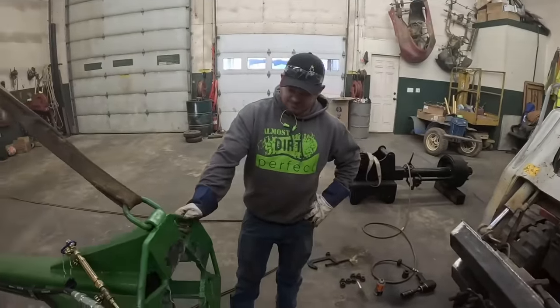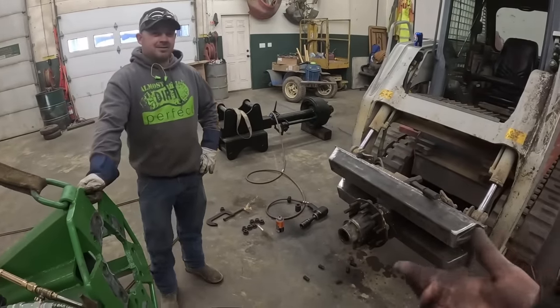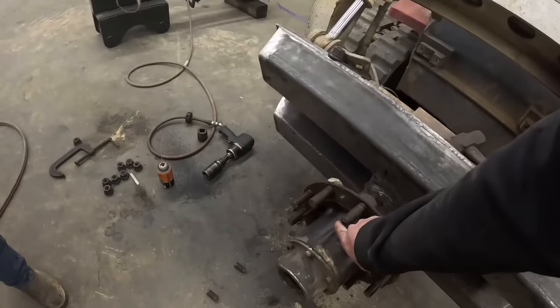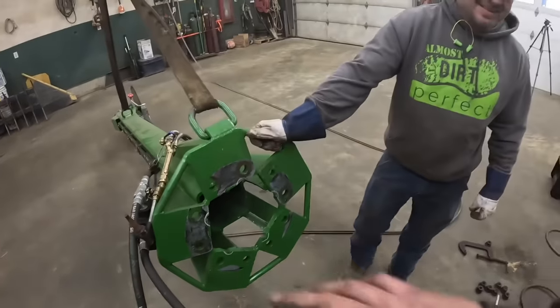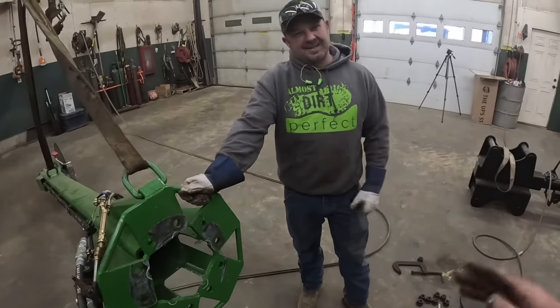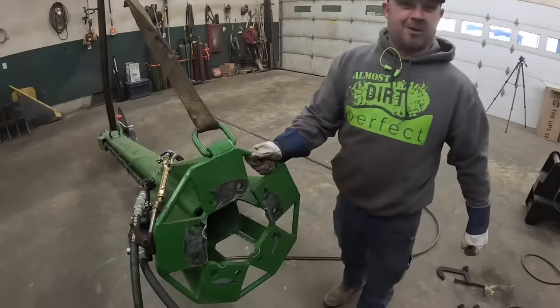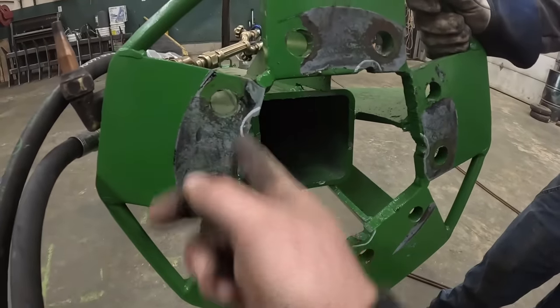Unforeseen issues, man, behind the scenes. I still don't know for sure what's going on, but apparently this thing has a left and right. So on that side of the axle, we cut tabs for these little alignment tabs, which are these little notches right here. Apparently whenever you flip this around and try to put it on the other side of the truck, the tabs go the other way. See, if we don't have it laying in there, it's going the opposite way. I don't know if you guys can see, we notched it this way. Well, now it's going this way.